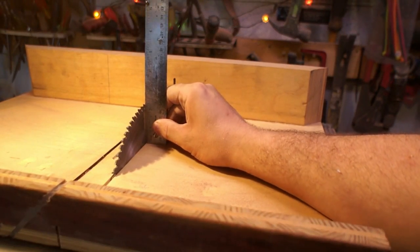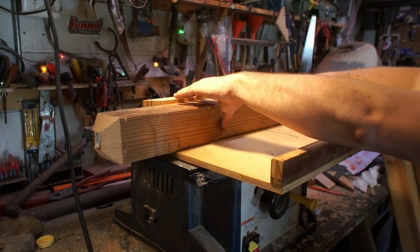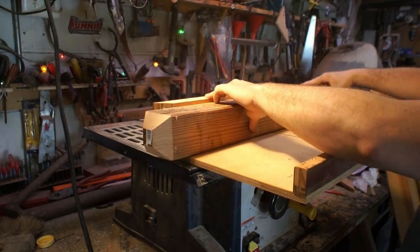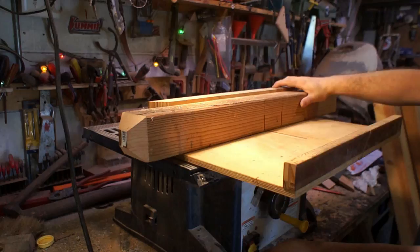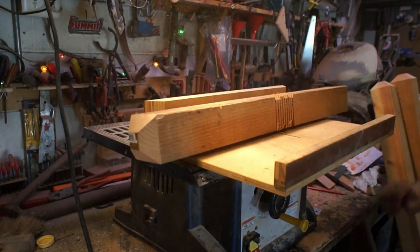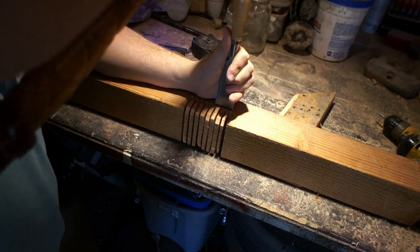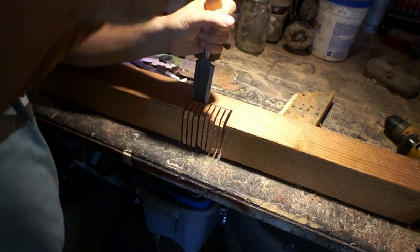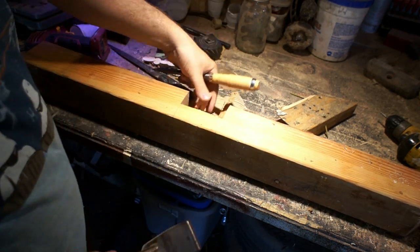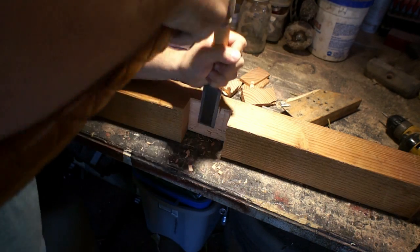While editing the video, a quick Wikipedia search informed me that I used a cross lap joint for these. Basically, when you have two pieces of 4x4 making a cross lap joint, you cut two inches into both sides of each piece where you want them to intersect. That gives those two squares places to just sandwich in and section together, and it gives it a lot of strength. I wanted a joint that wasn't going to rely on glue since it was going to be outside, so this relies on wood-on-wood contact.